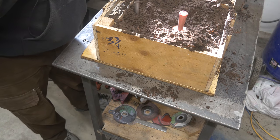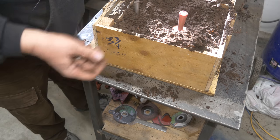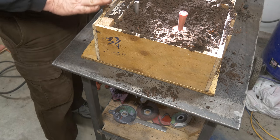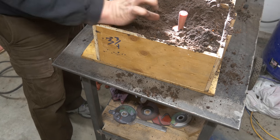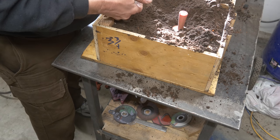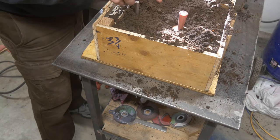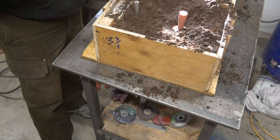I'm putting this feeder on here — it's not really even a feeder, it's more of a vent. It's more of a spyglass, really — a thing for me to look and see if the metal is actually coming up to the top. The top of my sprue is just barely above the top of my box, maybe half an inch. The intent was to get as tall as I could, so I'd have gravity helping with self-leveling and getting the metal up into this riser, this vent, this viewfinder — whatever you want to call it. It's really not big enough to be a feeder and it's huge for a vent.